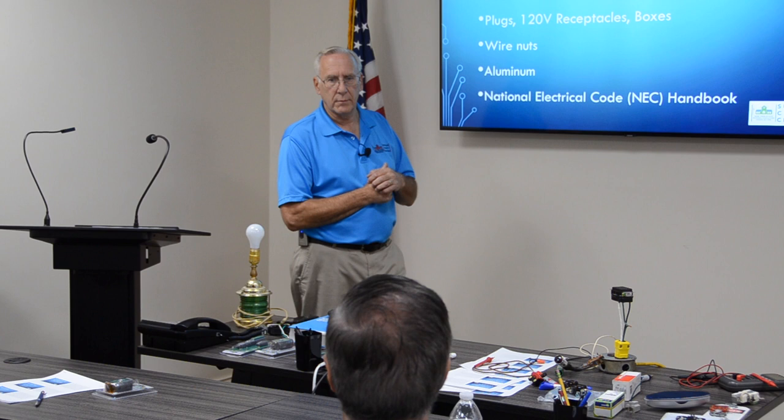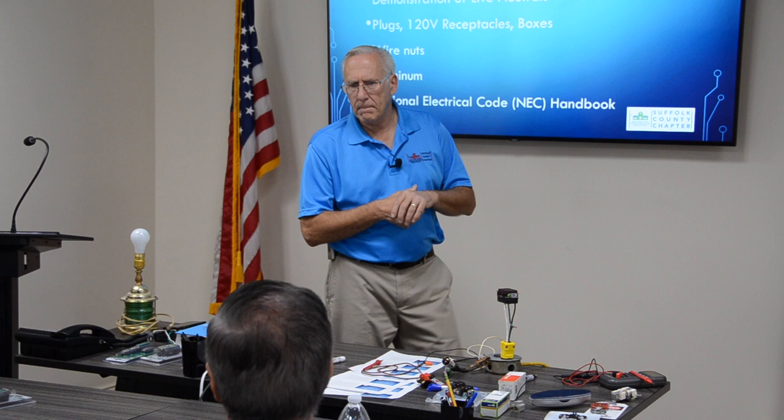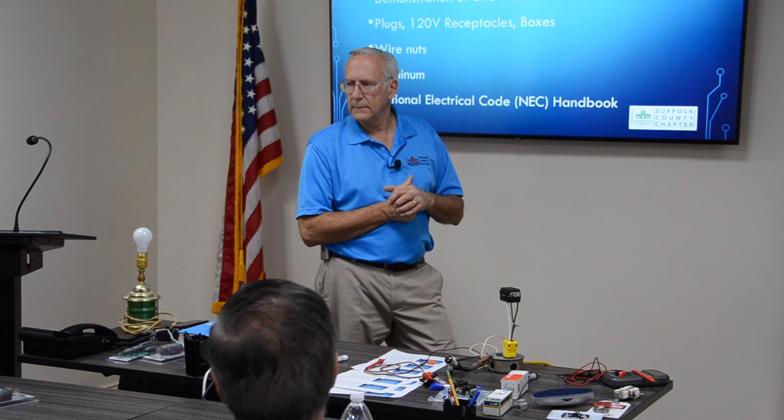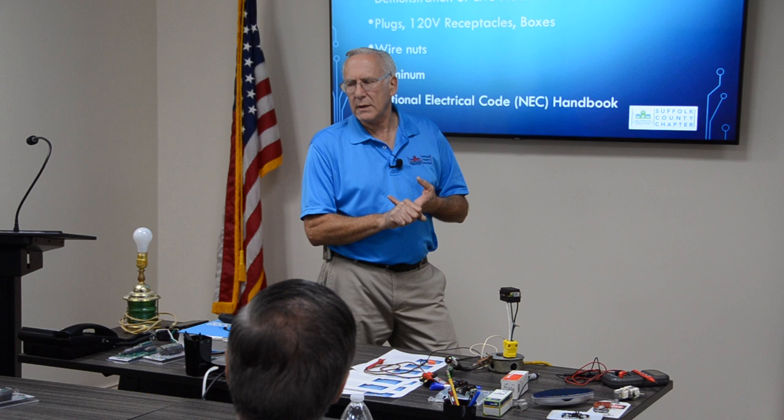My house was. Yeah. Were they pigtailed? Is there a cure for aluminum wiring in your house? The short answer is no. Elimination is the only cure for it. They have tried all kinds of things: Penetrax, wire nuts, Buchanan splices. They tried 100 different things, and none of them really worked that great. Pigtailing is about the best, the Penetrax with the copper pigtails.